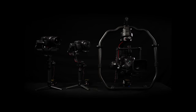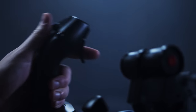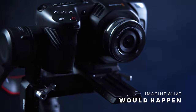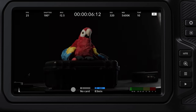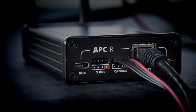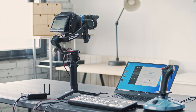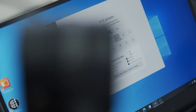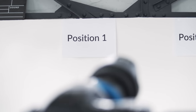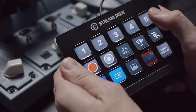If you want to go a step further on camera control, there's a free software we built that allows you to use any external joystick to control the iris, pedestal, zoom, focus, etc. You just run it on a laptop, connect your laptop to your switcher router, set your ATEM Mini Extreme IP address, and then you can custom map any joystick axis and buttons to camera settings. We will also soon release a hardware device that can connect to the DJI Ronin S2 so that you can use it as a PTZ head with the ATEM Mini Extreme. With the joystick you can control pan and tilt precisely, save position presets, and recall them later with our software or using Companion with a Stream Deck.